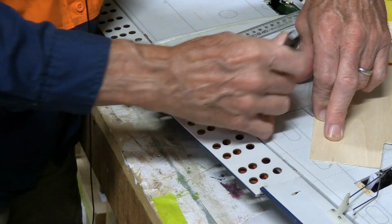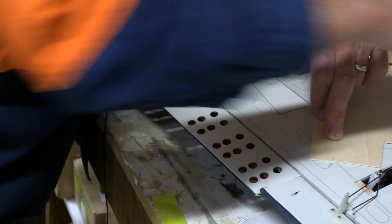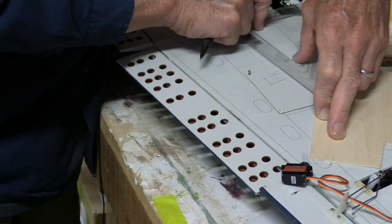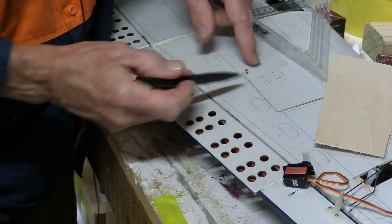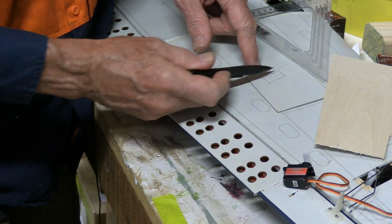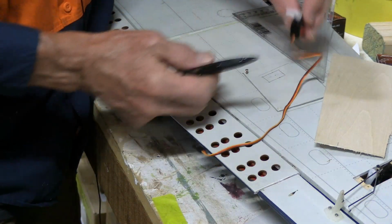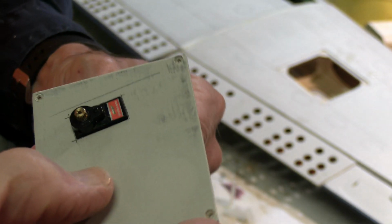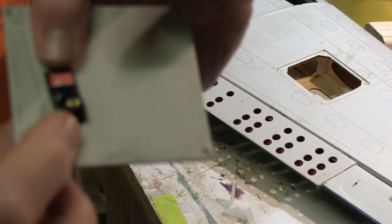And then if I want to have the square ends for the servo, I can use this side of the triangle. This is a 45 triangle. Actually, any of them would work. And then we just need to get the length, which I think is 25 if I remember right. Okay, so it's going to be right about there if I can get the triangle to stay put on the plywood. Okay, so what that has given me is a nice rectangle with square corners, and I've got the rectangle parallel to this line that I want here. So everything is going to be nice and straight when I get my servo installed there. So we now have our hole in the panel, and the servo will just go in from the back into it like so, and very little of it sticking out. And so just mark on the back, and I'll use tiny bolts to fasten it on there.